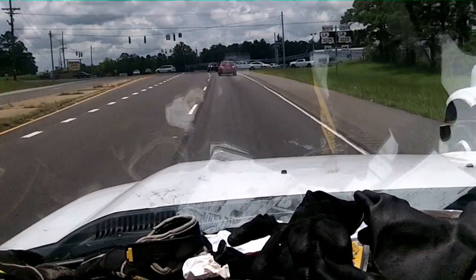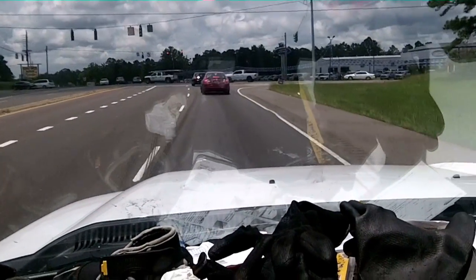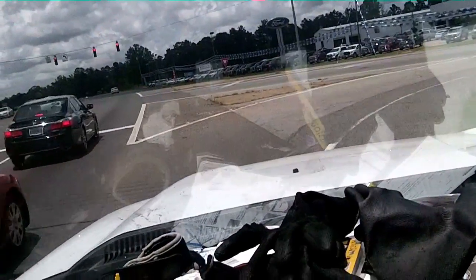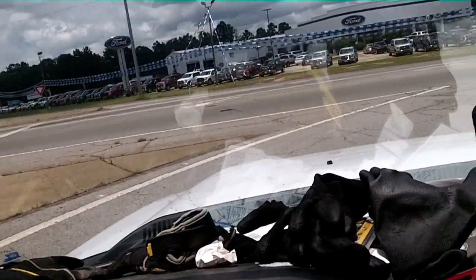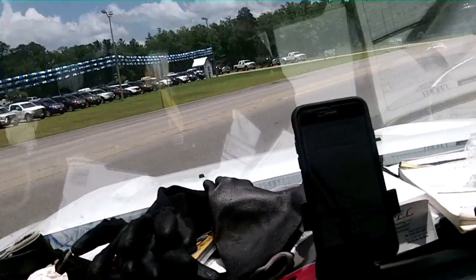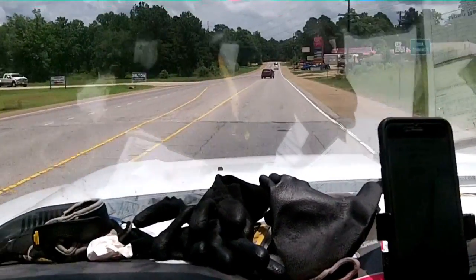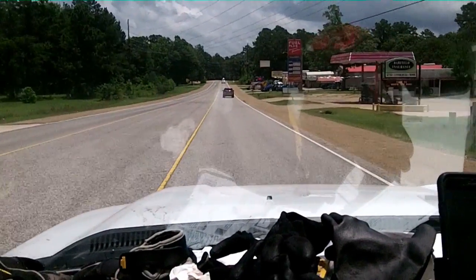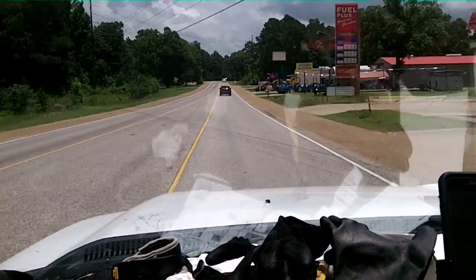I came out and found a bad blower motor. I didn't have a motor on the truck. But the wheel is caked with dirt, and that's what killed the motor. So if the wheel is like that, I'm guessing the evaporator is the same way. I did not take the cover off the evaporator because it was late Saturday evening.